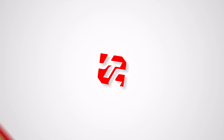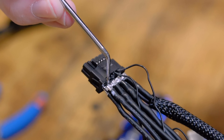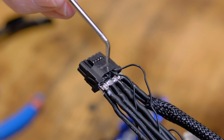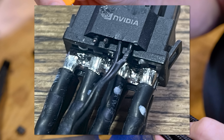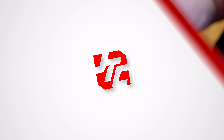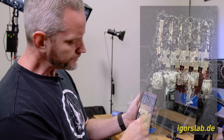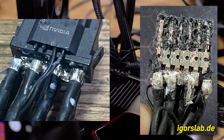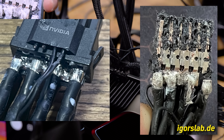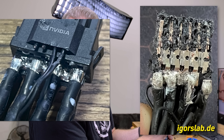Alright, we've got to cut into this. So there's the soldered deal in there — you can see one, two, three, four wires soldered across this foil piece underneath, and that's where the six pins meet it on that side. The plate they're soldered to is very thin, so the thinness of that plate carrying this much current increases the resistance, and any extra resistance equals heat. We're at 47.5°C on the wire just above the solder. This right here is a broken solder pad that broke while trying to pull the rubber off — that showed how delicate it was. We're noticing the solder on mine doesn't look as gross as this one. His broke off, which means these three cables are now responsible for all six wires needing to carry the voltage, amps, and all the current.